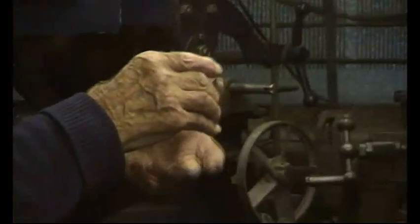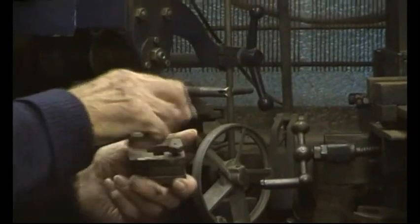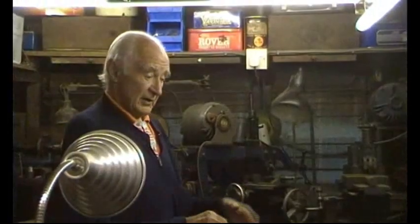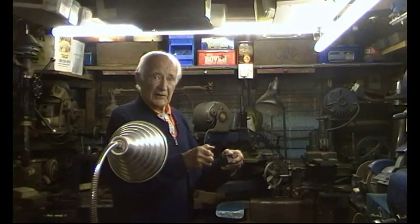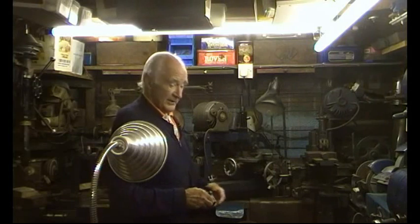Do you want to show how much slop's on that? That's the sort of mould that we would use. The spindle goes in there. Heat this up to a good heat and pour the aluminium in. Open it up, strip it out, and the nut's made. You've just got to screw it out to get it started in the thread, and then just screw it off. Put it in there and away you go.